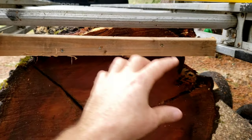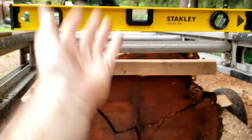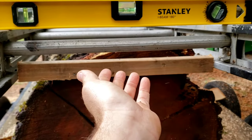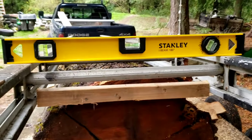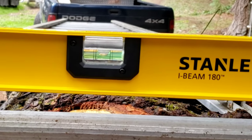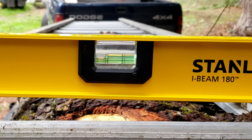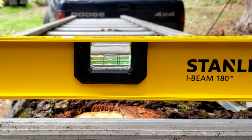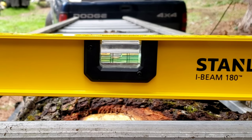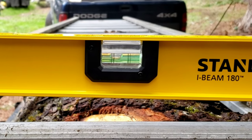Once you have that off-cut you can always flip it over and mill another slab off of it, but it's nice to just set it up once and have the smallest off-cut you can. This is the flexibility of using scrap two-by-fours to mount your system versus having brackets that are always a set thickness off the bottom of your ladder, which forces a huge off-cut. Also — about leveling — if your whole ladder on one end is tilted a certain way, as long as you match that on the other side, you won't have a twist.